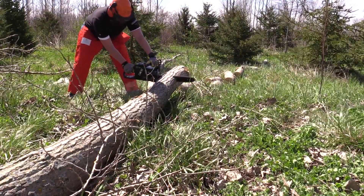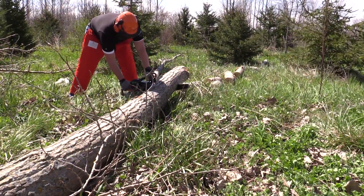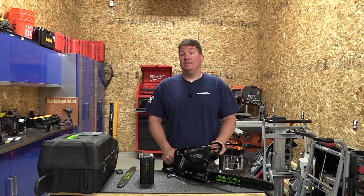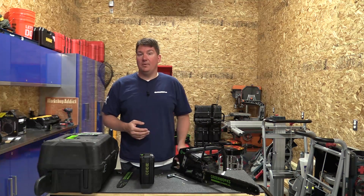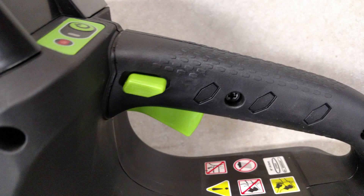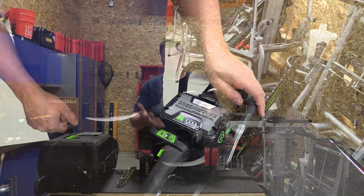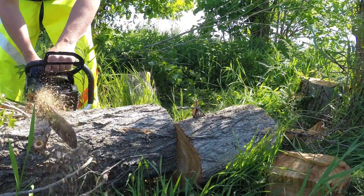For arborists, there are two things that differ from gas. First, there's a safety switch on the left side of the trigger — right-handers use their thumb, and left-handers can use their trigger finger or palm to depress it, so it's not a big deal. Second, there's an on/off button on top, which is great for climbers: you can turn the unit off with the battery in it so nothing accidentally activates the safety and trigger, adding an extra layer of safety when stored or carried up a tree.